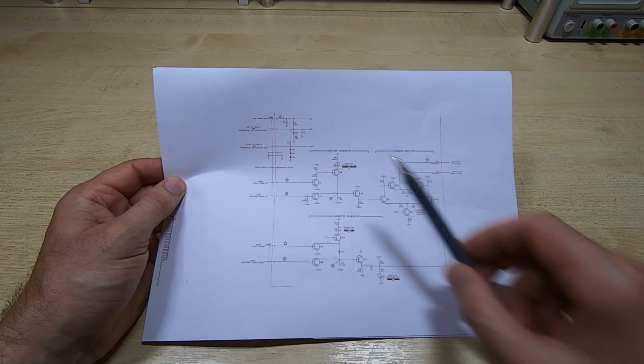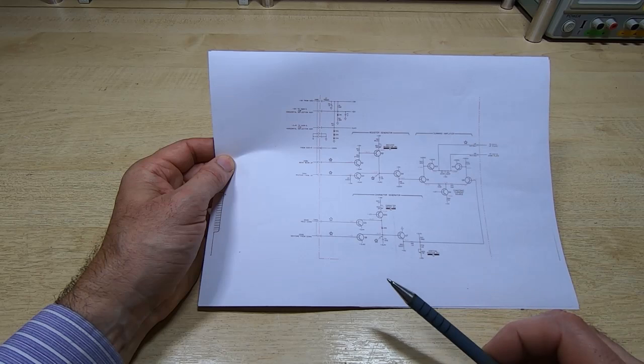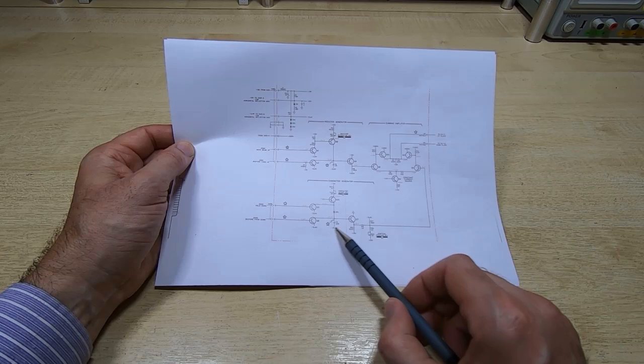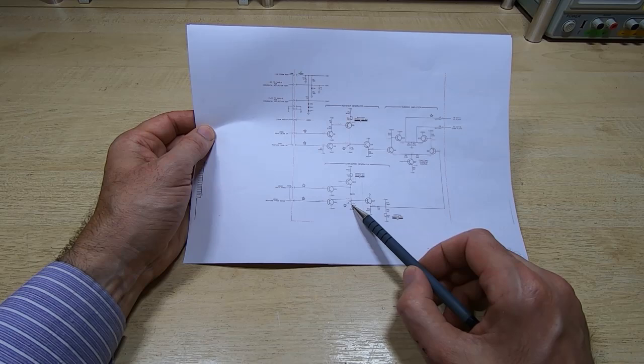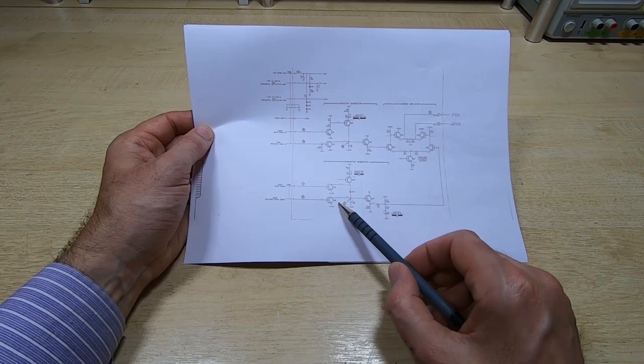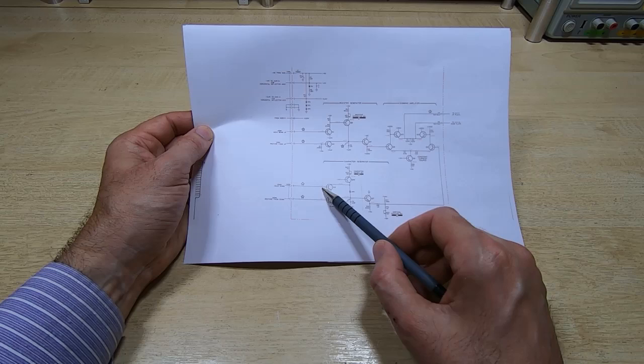But notice there are only two inputs for this, and two inputs for the top, even though it's doing a fairly complex thing here. And the way this works, it's based around a single capacitor, and these are the large capacitors we have on the left of the board. And all the system does is it charges or discharges the capacitor. So it has the ability to put a short pulse onto either the bottom transistor, which will discharge the capacitor, kind of resets the output to zero, or it can momentarily turn on the top transistor.